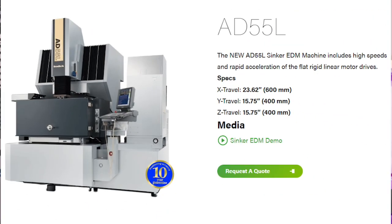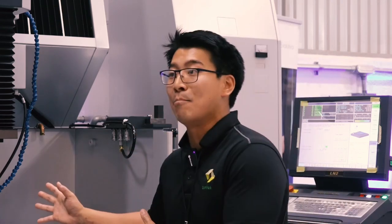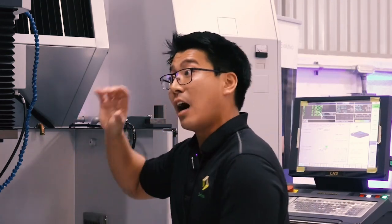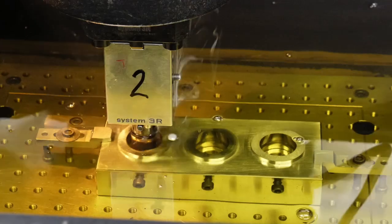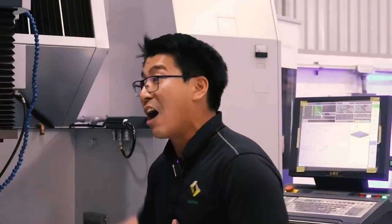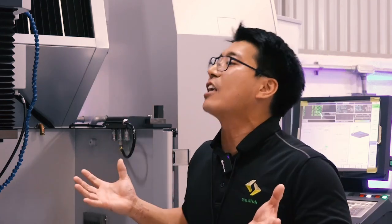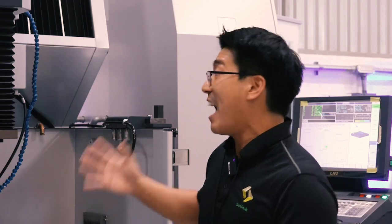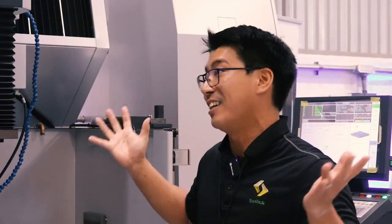So, obviously we've got our AD35 — this is our entry-level machine. However, it has all the core technologies that Sodick is well known for: our rigid linear motor drives with our absolute glass scale. No other company can mimic that, and we really design our whole machine around that technology. We have our graphite electrode — you can also use copper electrode to get closer to the workpiece. Why Sodick? It's really that rigid linear motor drive and that speed — 1440 inches per minute. When we're down at the workpiece we're discharging electricity, but the more magic happens when we're going up and away from the workpiece — we're basically vacuuming away all that debris. No other company can offer this flushless machining.